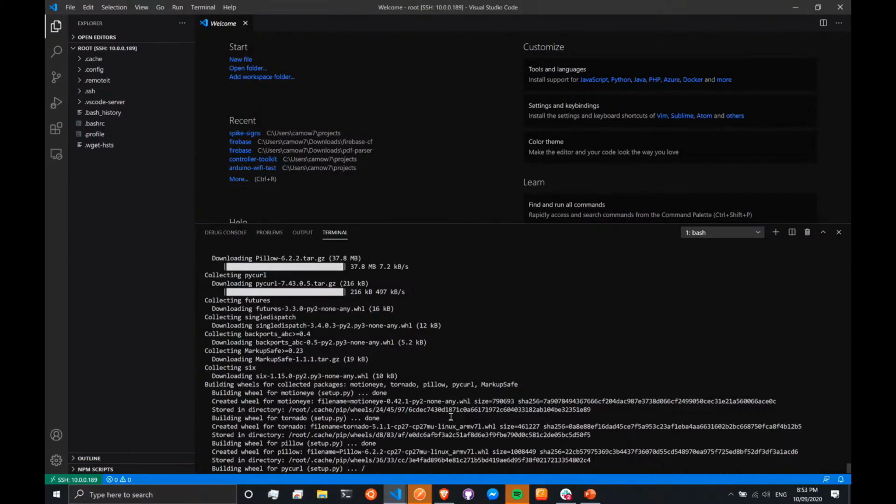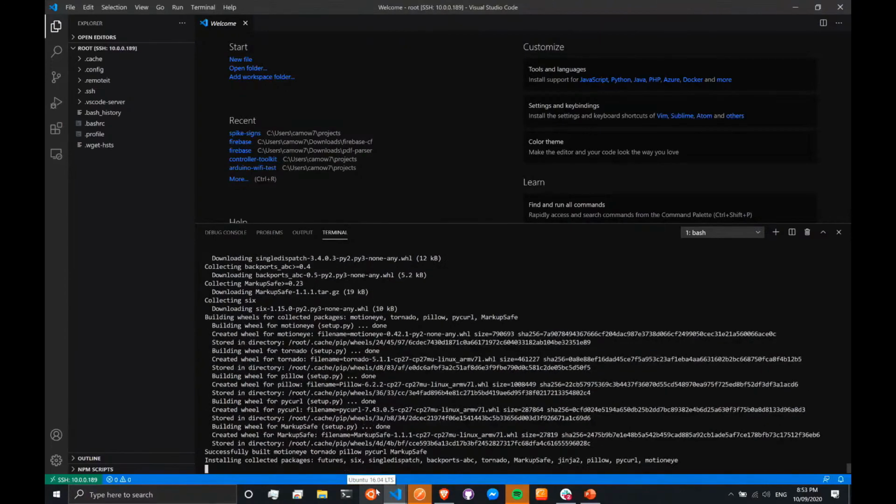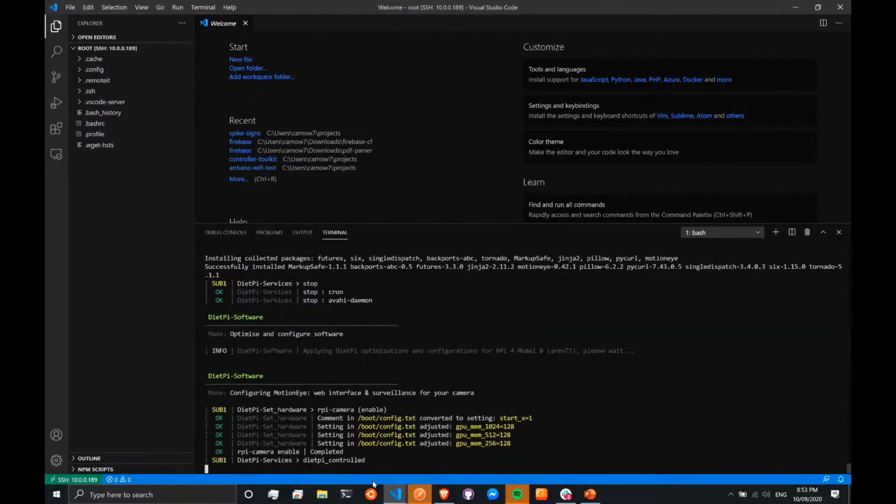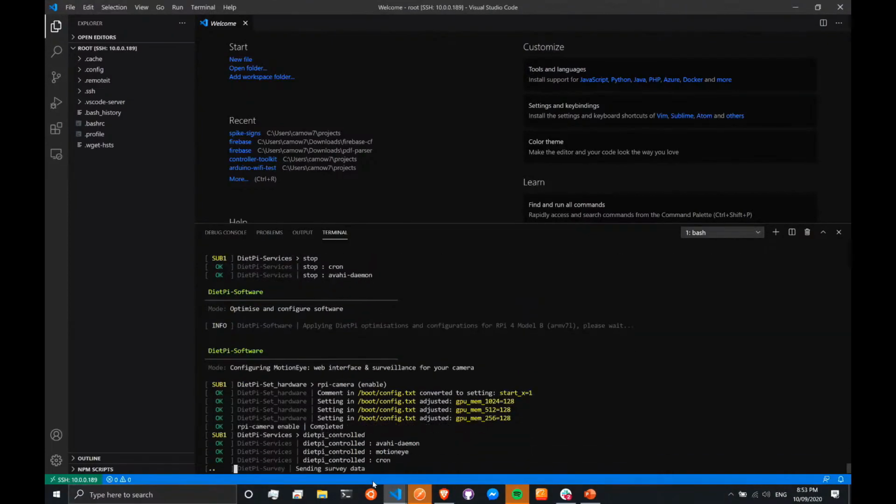But yeah, you can do it with one. You can also do it with the Raspberry Pi cameras. The disadvantage with that, or the reason I didn't want to go down that route, is I didn't want the Pi with the camera. I didn't want someone to be able to just go up and smash the Pi off the wall. They'd have the SD card, literally everything. So basically I have this USB camera mounted, and then the cable runs inside the house all the way to the Pi where it's a bit more secure.